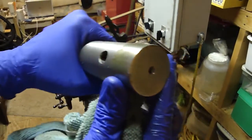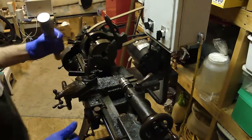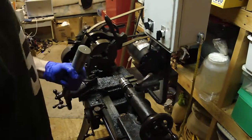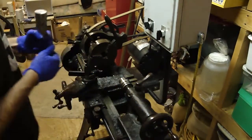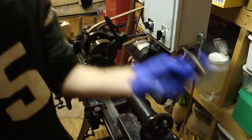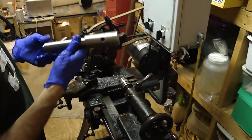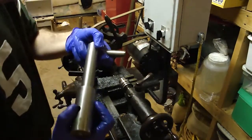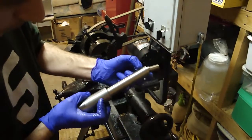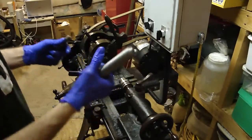And there's the little recess in there, and I'll squirt some lube in there. I'll probably use grease, and I'll dope the grease with oil every time I get a chance, because it's going to be riding on this center, and I assume it's hardened, being as how hard I just clamped down on those jaws, and it didn't leave a mark. It hardly left a mark on here. There's a little bit. They hardly left a mark on this piece. This is pretty good steel.